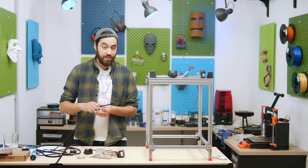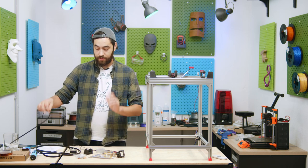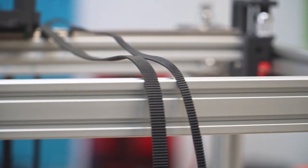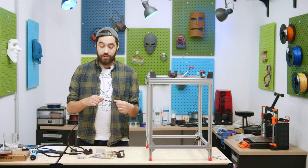One thing that really wasn't mentioned that we should have mentioned was the belts on 3D printers. Most Cartesian style printers have these 6mm belts — they're pretty normal and fine for Cartesians — but with a CoreXY they use much thicker belts like this one which is 10mm. This is because with this motor system there is a risk of stretching the belts, so larger ones spread the force to prevent this. There is also extra grip with the large surface area on the pulleys and idlers that prevent any slippage.